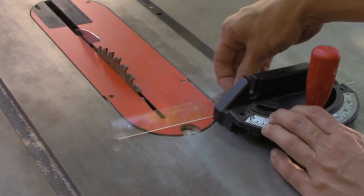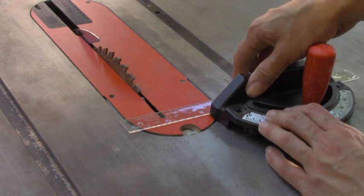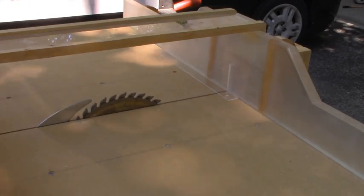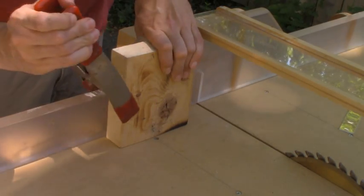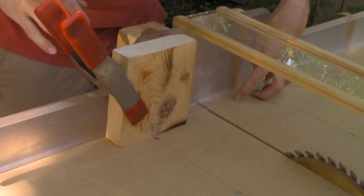For instance, I don't recommend using the miter gauge at all. Acrylic generally is too slippery — it just doesn't stay in place when you're making the cut, and I never get a good straight cut when I'm cross-cutting with my miter gauge. For accurate cross cuts on small and medium sized pieces, I recommend a good cross-cut sled. You can set up a stop block with a clamp for making repeat cuts, and everything's just the way it is when you're doing regular woodworking.